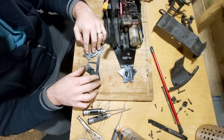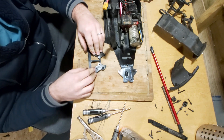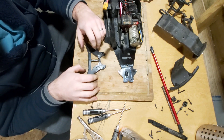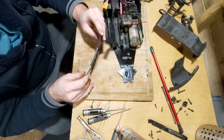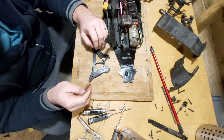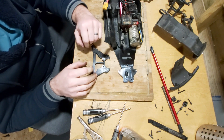Nice little bow in there. I'm thinking now that I can actually get that pretty straight and I don't think it's going to be too hard. Now, if you had more of a bow than that, I would suggest that you heat this up before you bend it back, because if not you might crack it. I'm going to try and give it a go without heating it up actually - I don't think it needs it. It's not quite bent enough.